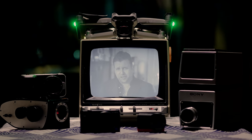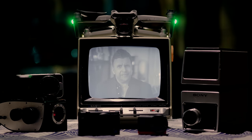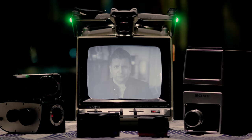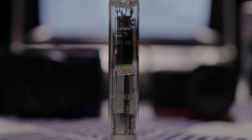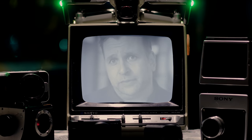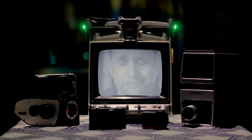Rather than change the system and describe newly developed camera sensor sizes by their actual size, some boffins somewhere decided to double down on the madness. A complicated hypothetical measurement system was devised to continue naming sensor sizes based on what it would be like if they were inside a vacuum tube. This is called the optical format, where the diagonal measurement of a sensor is multiplied by 3/2 to give you what the tube measurement would be if that sensor was inside it.